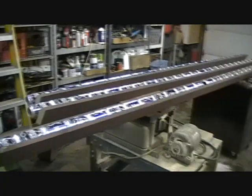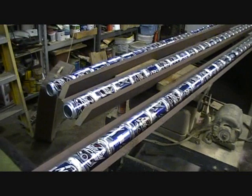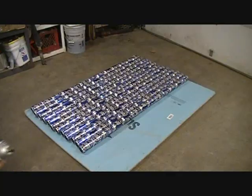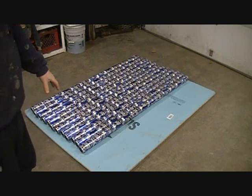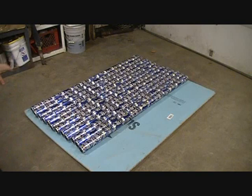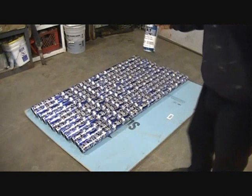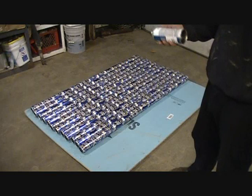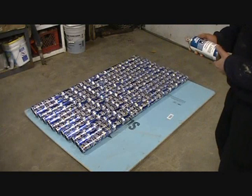There is exactly half of what I need — thirteen cans tall, and I need twelve rows of them. There are six there; they're going to dry overnight, then I'll start on the next row. I'm going to paint these up. It's a little easier to do it in the box because I can turn them as I go. Every single can going into the project is right there. As for paint — El Cheapo flat black spray paint. The goal is that the box won't get hot enough to destroy the paint because that heat will be going into the house. The other box I built used cheap spray paint and it worked great, never caused any problems.